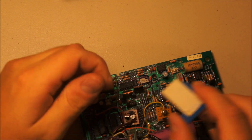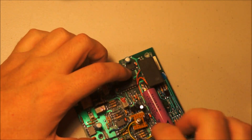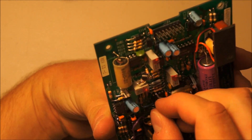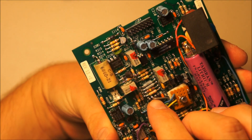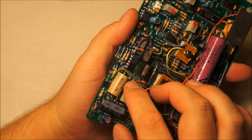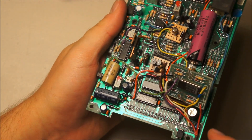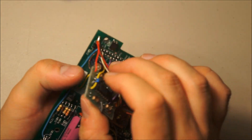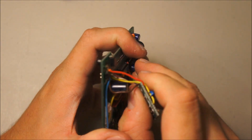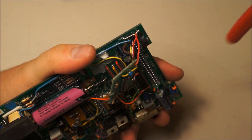That appears to just have been intended to support this board. Look at that — there's a gray lead running right into, soldered onto the leg of one of those eight pin DIPs, then going to resistors. And here's another one going onto a resistor as well. That right there is tacked onto a diode. There's a whole mess tacked onto the backside of this big giant interface cable connector. There are actually two wires tacked on right here.